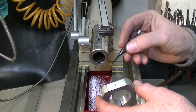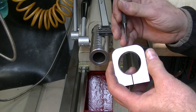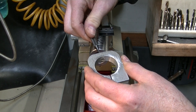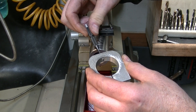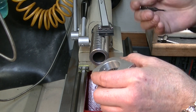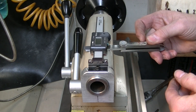I've got a new little tool here — this is a Noga deburring tool. It's a tiny little thing, and this is supposed to help deburr the inside of round holes or blind holes. This is the first time I'm using it. The idea is to get it in there and just rotate. It is working — that takes the burrs off of the tapping. It's definitely doing it. You pull it out and that's it. That's pretty smooth. Feels just right.